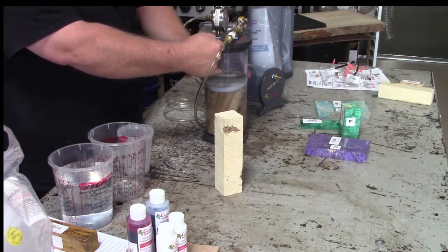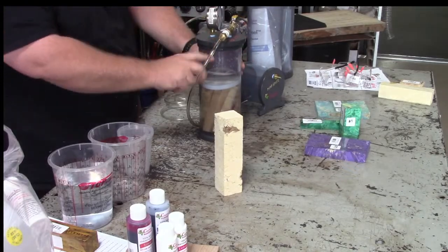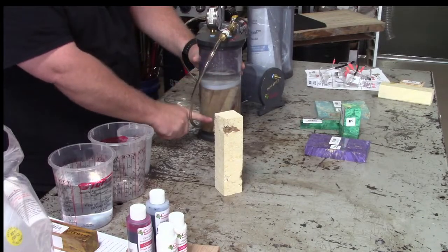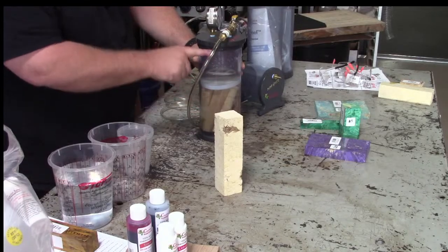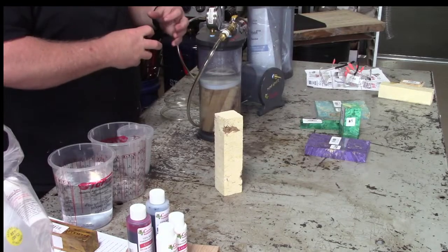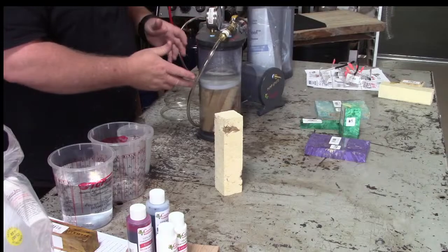I've vacuumed all day on something and left it with this much resin, left for the day, and come back the next day and it's down here. So overnight it just sucked it all in. And I went below the wood, so then I just redid the process, because obviously it's going to suck more air in when it's exposed to air. So it's kind of a cool thing.